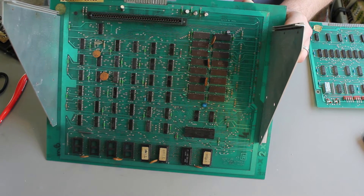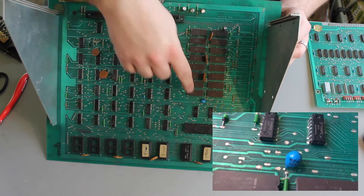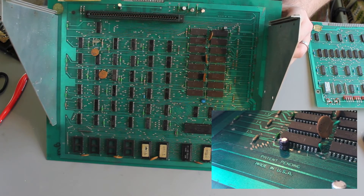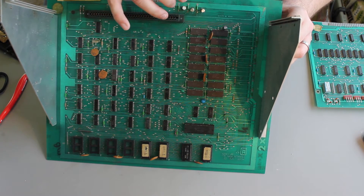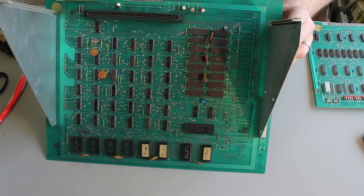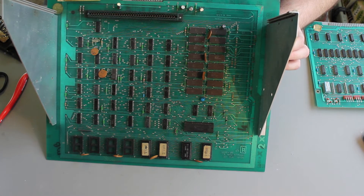The others I'm going to leave as they are because they're not essential to the functionality of the board — if the power supply is good enough, a lot of these don't really do anything at all. There were two tantalum caps on this board: this little blue guy here that looks like an M&M, and then one that had lost a leg which I already replaced with an electrolytic. Back in the day they used tantalums because they're very stable, don't vary in their values, and are very reliable components.